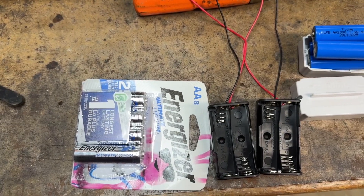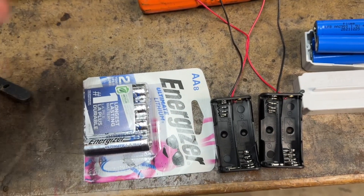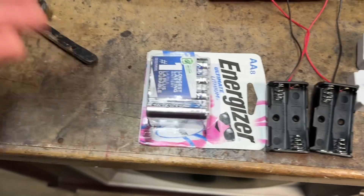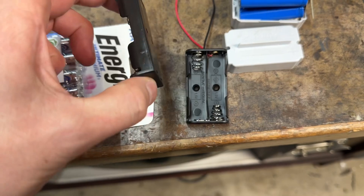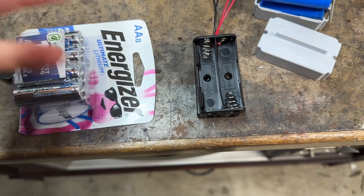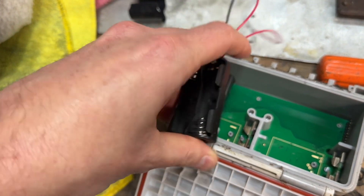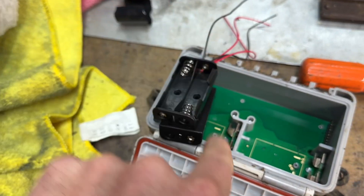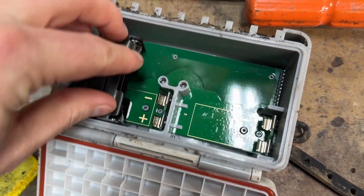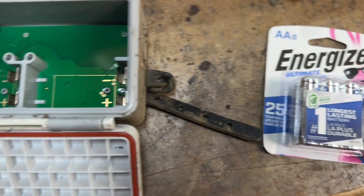These actually have 3,000 milliamp hours a piece - considerably more than an 18650, which I find really interesting. I guess they designed it to work on 3 volts. We'll just do it this way. What I did is I got a bunch of cheap Chinese battery holders - I think 12 of them for about 8 bucks. We'll permanently install two sets because we need two to get the capacity. One holder is 3 volts each - we'll put them series-parallel and install one here and one here. I've got 8 batteries here and that'll probably run this thing for a few years.